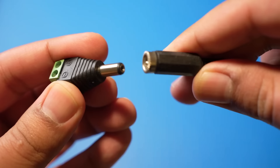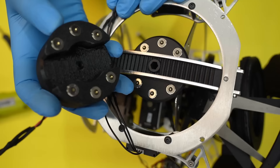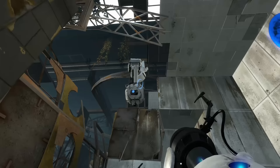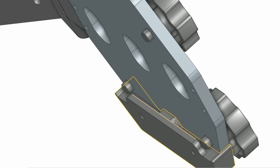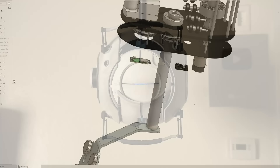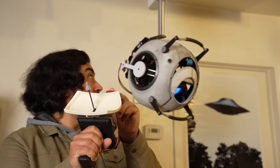But how does power actually get to the motors? I could have used a simple plug and socket, but I found these magnetic power connectors that are, in technical terms, totally sick. I'm using a matching set of six connectors to transfer power from the management rail into Wheatley. Now, Wheatley will die if disconnected from his management rail — fitting. The magnetic power clamp hinges on a large steel bracket that screws onto the base of the tube, with a 3D printed lip matching a notch on Wheatley's mounting plate, so I can align and secure him with four large thumb screws. For control, I've got an ESP8266 mounted in the lower enclosure, and using my Wrangler with an ESP32 and the ESP Now protocol, I can pass joystick information for full control of the carriage.